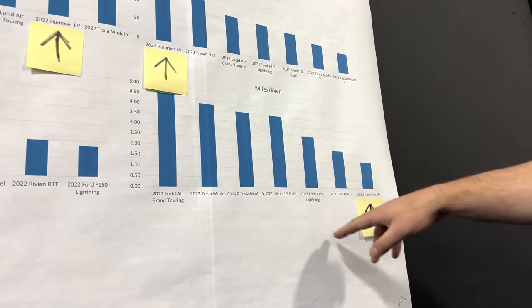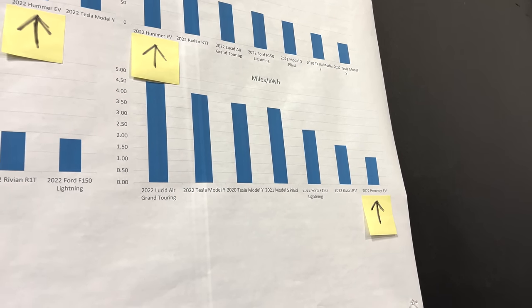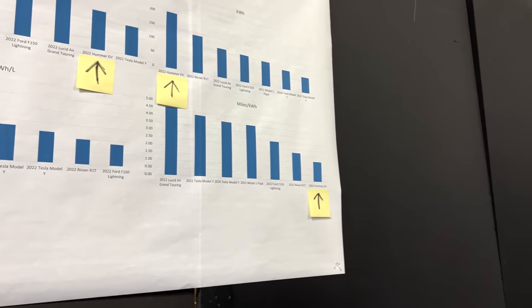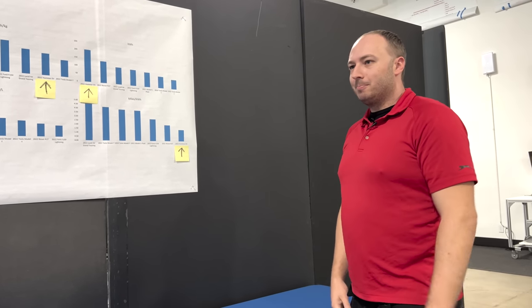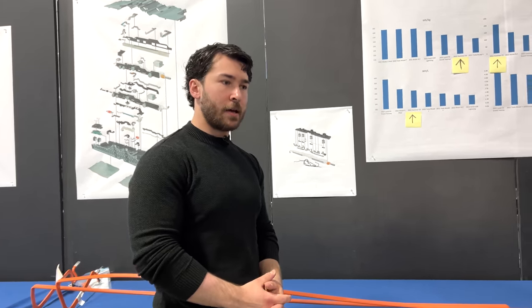The Rivian falls below the F-150 Lightning, which speaks to efficiency and design. Cylindrical cells are performing a little better because of the way they can be packaged and the ability to put more in parallel. There are also more aerodynamic cars. This was a 9,000-pound vehicle — that mass alone has a substantial impact on mileage despite any powertrain efficiencies you can gain. If you're fighting mass and don't eliminate it, there's only so much optimization you can do. That wraps up our overview of the Hummer battery pack today — a few more of these will be coming up, so thank you for watching and stay tuned.